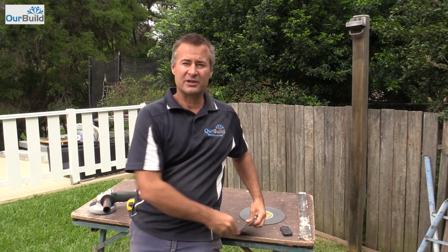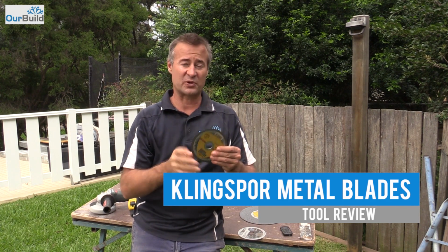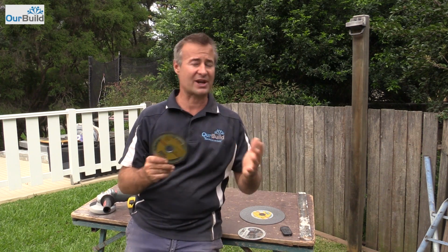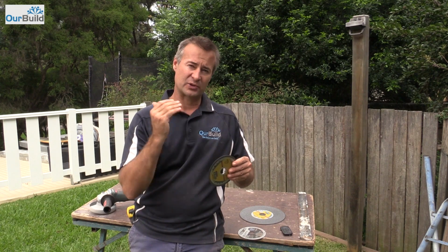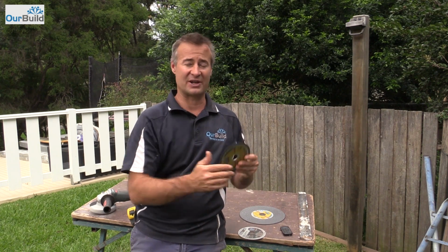Now, more importantly, I'm going to talk to you about their 1mm cutting disc, their metal cutting discs. The reason I've chosen the 1mm is because it's probably one of the highest selling metal cutting blades on the market at the moment. This is probably the best all-rounder for cutting through stainless steel or all types of steel. And the good thing about it is being so thin, 1mm, it actually cuts through a lot quicker, doesn't leave as much burring, and it doesn't have as much thermal mass on the actual steel that you're cutting.